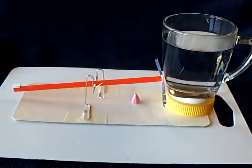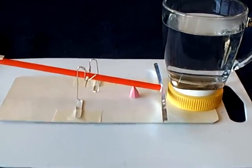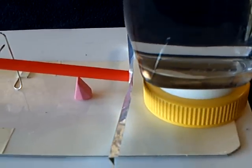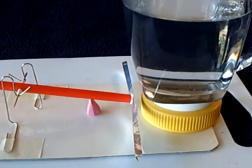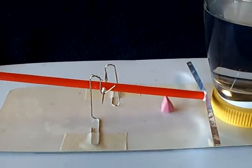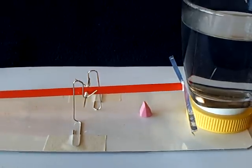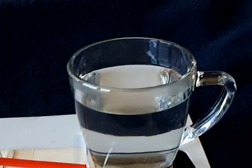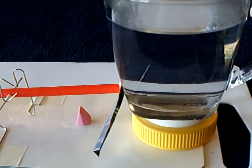I just had to see if I could make one, and it does work, and it's extremely simple. It's a heat engine, and that piece of element right there bends when it gets hot and shifts the center of gravity down along that straw and makes a teeter-totter. Very similar to the drinking bird kind of motion, but this has nothing to do with evaporation. The heat's coming off of this glass of hot water here, so this is really an LTD heat engine.